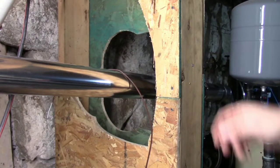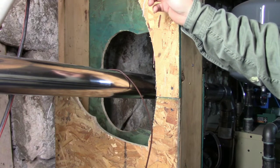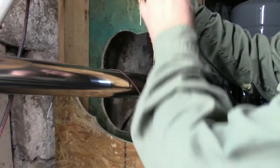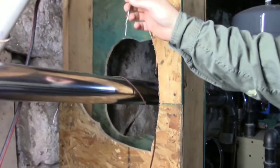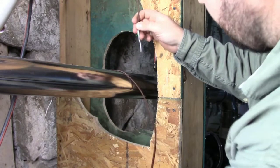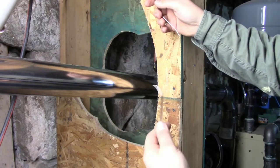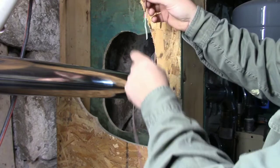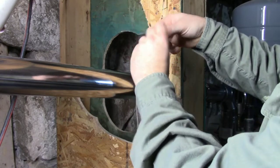I've disconnected the wire from the circulator panel so there's no power on it. Always do that first — turn off your boiler, shut the power off completely, take the wire out, make it safe, then you can work without fear of being shocked. I cut this wire; it goes up into the ceiling. Now I want to show you how I splice wires for pulling. I cut back the sheathing and tie in two of the wires, creating a hook — that makes a really strong connection.